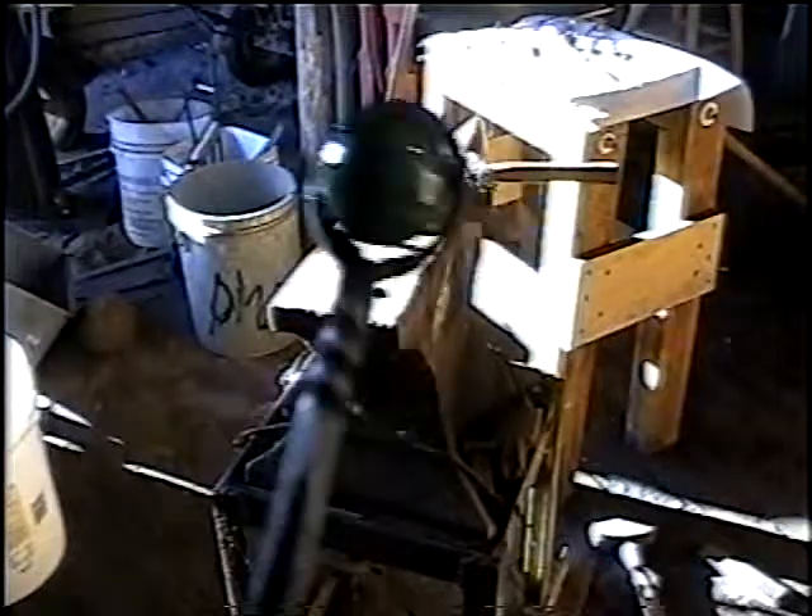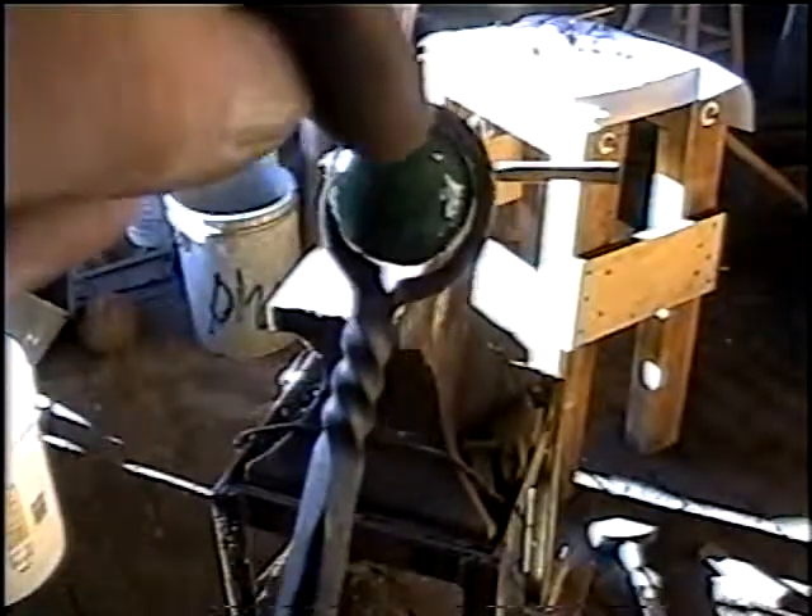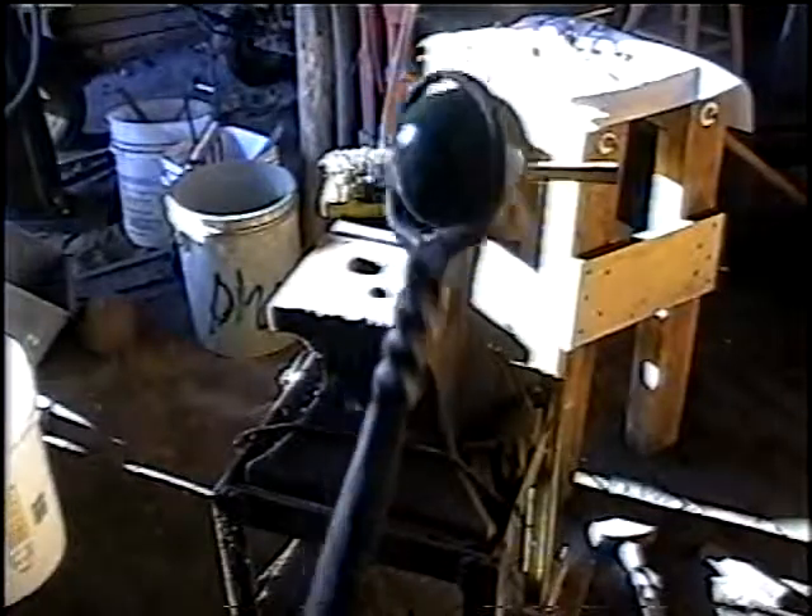Don't look too bad. These tines could have been a little bit smaller, or they could come around more — it doesn't take much to hold that marble, but you just don't want way too much. If you haven't used a vise, a lot of times it's good for drawing out tines — put it in the vise and bend it, then you can draw it out on the anvil. It makes it a lot easier if you've got long handles. If you've got a real short piece, it's not worth doing. You don't want a sharp bend — you want a good radius so you can straighten it back up.